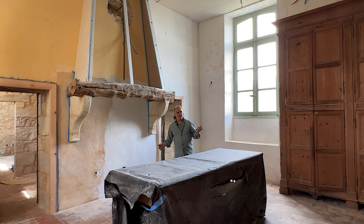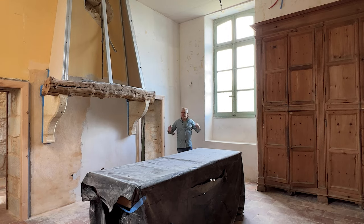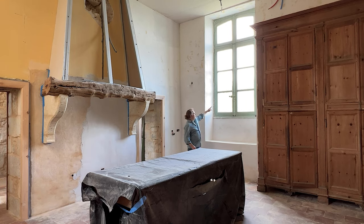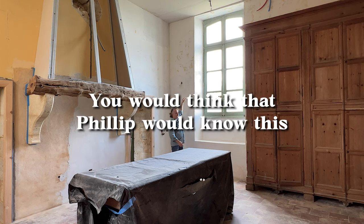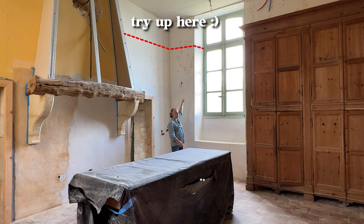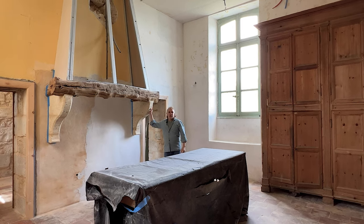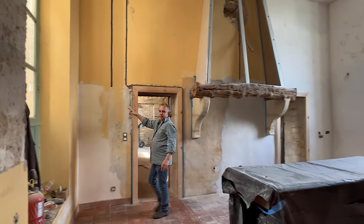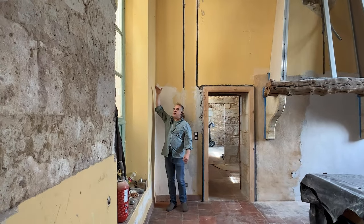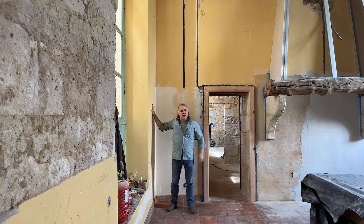And while we're talking about tile, I'm gonna point you to this window. Because on this wall next to the cabinet, the tile is gonna go, if you count the first pane and then the second pane, that's gonna be the height of the tile. And it's gonna cover the walls from the cabinet into this corner and then coming across. And then as we get into the corner over here, our tile height's gonna come down a little bit to about here, right? And then kind of cross on this wall here.